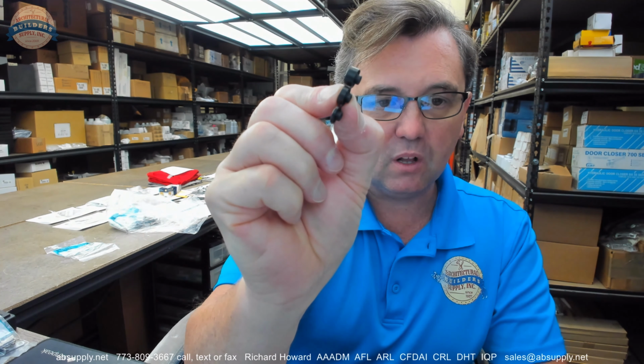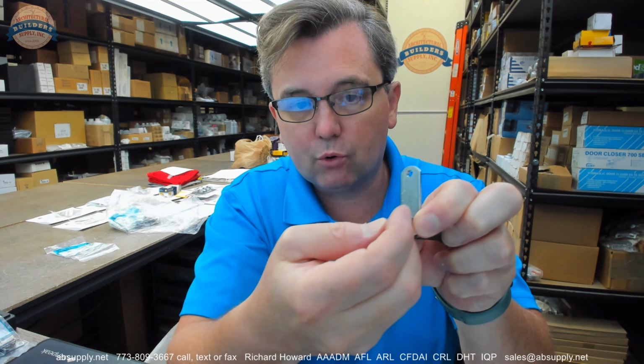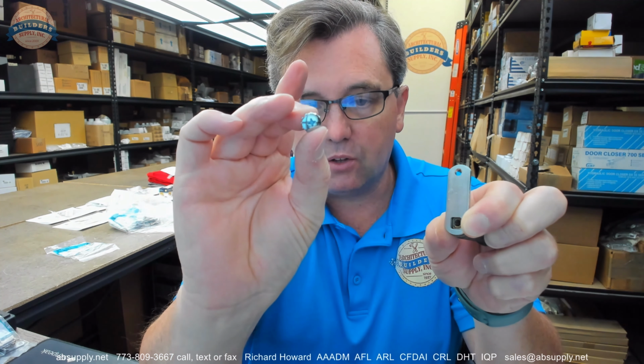Those holes are for these press-in adapter pieces that will allow you to really tailor the installation, meaning the length of the cylinder body, how thick the material is that you're installing through, and the length at which the cylinder has to travel to position the cam in the backside so that when you lock the unit, it is making contact with the back of the framework. It all conspires to allow you to tailor that as best as possible. You'll have the small screw for holding the cam to the back of the cylinder body. That screw will go right there and will keep the cylinder from coming out.